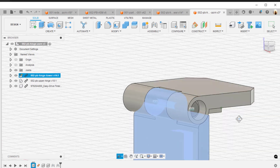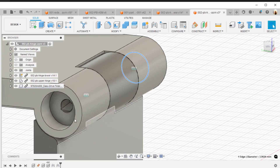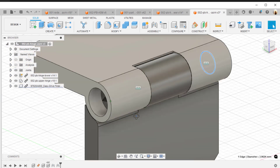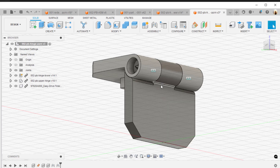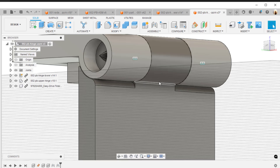Turning off the section analysis, you can see the nail already loaded into the hinge assembly. The point of the nail comes out on one end — that will be covered with epoxy, along with the other end, to stabilize the pin inside the hinge assembly so you won't lose it. Now, there are two things wrong with this assembly: the color of the plastic on the upper part is lighter because I never set the material type for the lower hinge part. More critically, there's no fillet at the intersection, which is needed for structural integrity given the wear and tear of opening and closing the portfolio box.